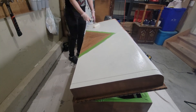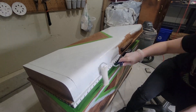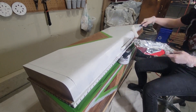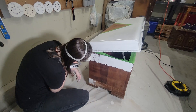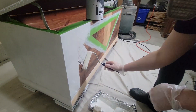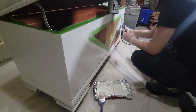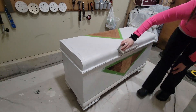Once all the tape was sealed with a little primer, I went ahead and primed the rest of the piece. I'm using Zinsser's BIN shellac-based primer. This piece didn't really have any bleed-through, so I only did one coat of primer — it actually covers really great. I've used the same roller and kept it in my fridge for probably four to five projects now. It still works just fine — I don't know why people would throw it out after one use. Reuse them; with regular paint you can wash them, and don't just throw them out after one use.